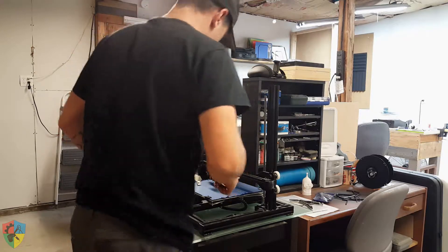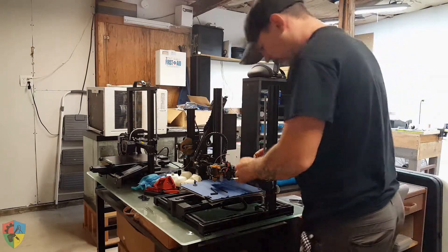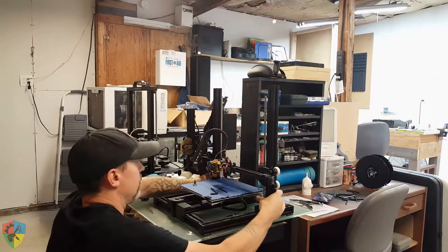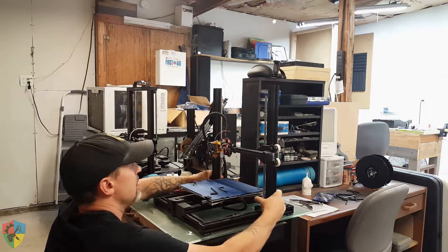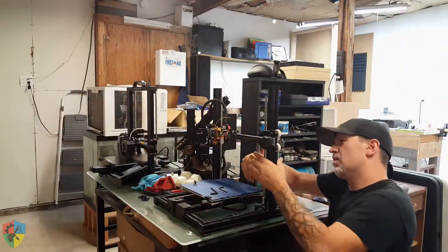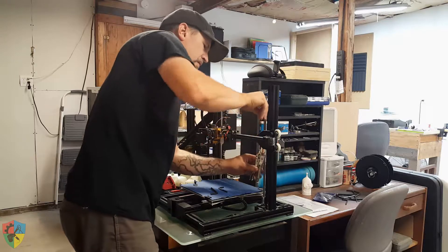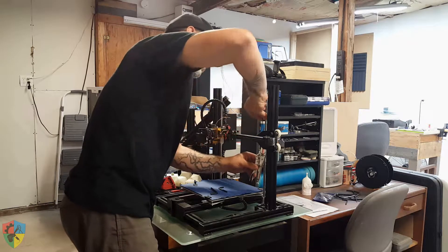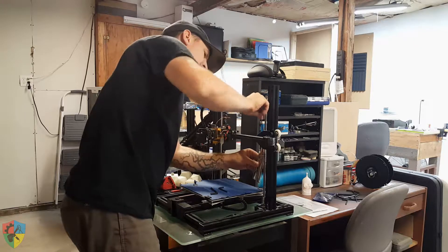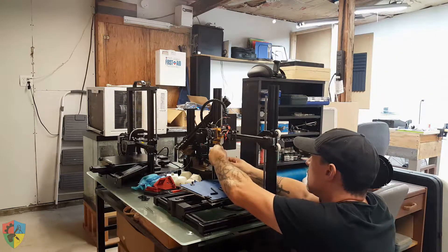That's going to be frightfully expensive and that's for down the road anyway. What I'm doing here is I took the very top of the frame off so I could actually remove the brackets. I wanted to keep things as simple as possible — you can see me here working the vertical screws so I can get at all the things holding the gantry to the vertical screws. I could have just taken them off at the motor, but I left the screws in place.